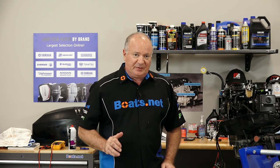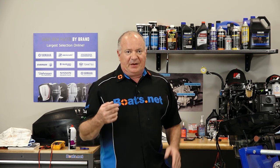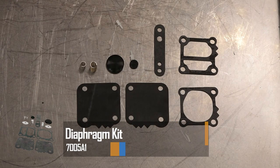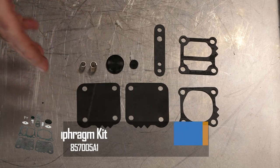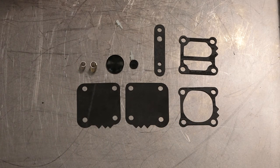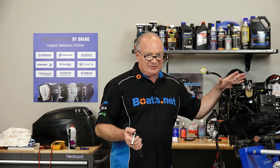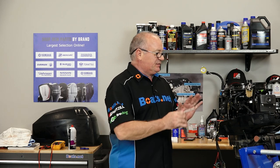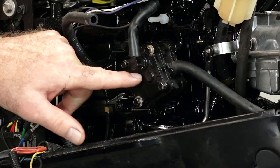Really simple to pull this apart. Before we get started, speaking of parts, let's make sure that you have everything that you need to get this job done. Now with Mercury, they have one part number that encompasses all the different pieces you're going to need to rebuild them. With this one part number, that's going to give you everything you need. Now as you can see, I've been busy working on this one because after all, we did build this one from the crankshaft up, so there's still a lot of different components that I haven't reconnected or remounted yet. Don't let that scare you thinking you have to pull yours apart this far just to get to the fuel pump, which is right there.